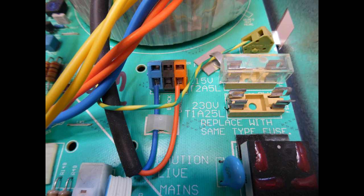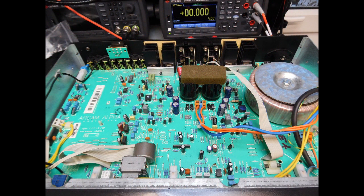The obvious choice was to check the output MOSFETs using a multimeter. This is straightforward: release the two fixing screws at the back of the amplifier to remove the metal plate clamping the left and right channel MOSFETs, then access the three pins of each device and check on resistance. No issue was found — no short circuits between any of the MOSFET leads.